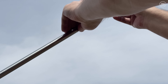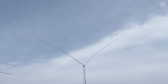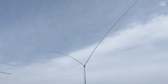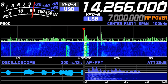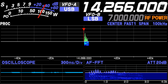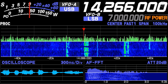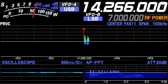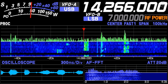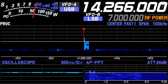The next band to try was 20 meters at 14 MHz, with the elements extended to near maximum. I originally had the elements pointing east to west but changed them to northwest to southeast. By mid-afternoon 20 meters had picked up a bit and I managed to make a quick contact with a station in Serbia — a lovely signal exchange with reports of 59 and 59 plus 10 into the UK.